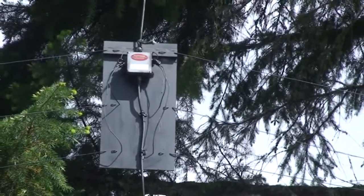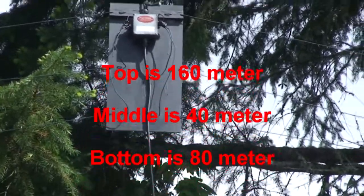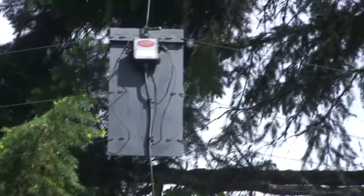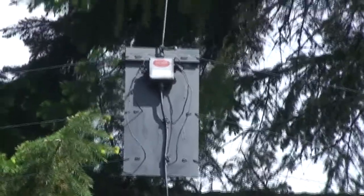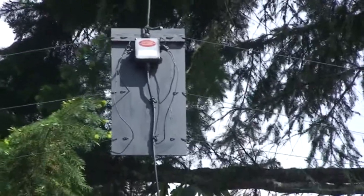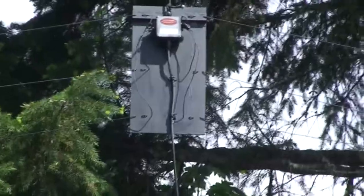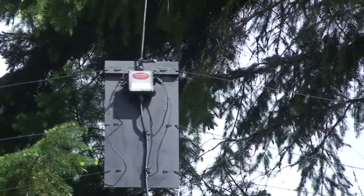You can see there's three lines going off — the top one is the 160, the middle one is the 80, and the bottom is the 40. That's a one-foot by two-foot black base with an oak bridge screwed to it, so the oak is actually supporting the main 160-meter wire. For the others, I just drilled several holes and kind of weaved it in, and then they're all connected up to a one-to-one balun.